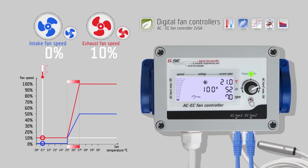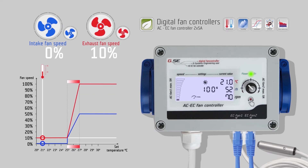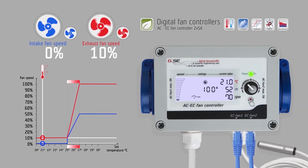Turn right to go to the maximum speed day setting. The maximum speed setting also limits the exhaust fan, and should never be exceeded during the regulation. The current maximum speed is displayed on the top side of the speed bar. Each missing segment represents 10% fan speed. For example, we set the maximum speed to 100%. These first 6 settings apply during daytime. The LED indicates the state of the fans with a constant light during daytime. During nighttime, the LED is blinking and the controller uses the next 6 settings, which are set the same way.